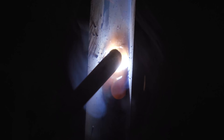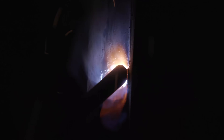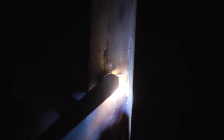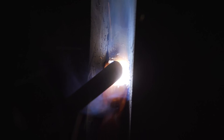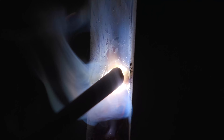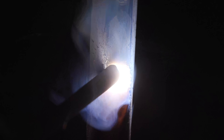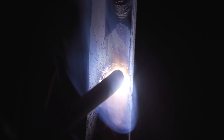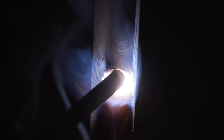We made the repair and got rid of that lack of fusion on the sides. I've brought the weld back up to where my initial root pass was, so now I can do my intermediate fill passes and then cap it. That's how you repair it: cut out the bad weld, gain access to it, put another pass in to tie back into the backing strip, get all three pieces — left side, right side, and the backing strip — all tied back in again. Then run your fill passes and set yourself up for a cap. Since we're talking about abrasives, make sure you're using the right product.